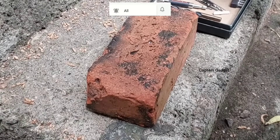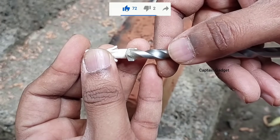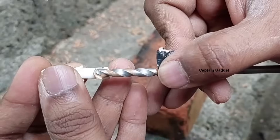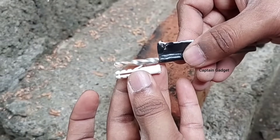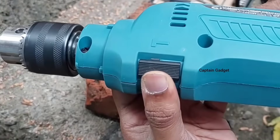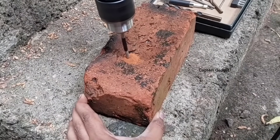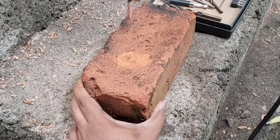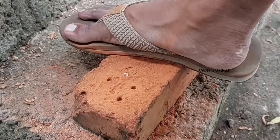For drilling brick, use a masonry bit. I am installing a wall plug — match the diameter of the plug with the tip of the bit. Mark the depth with tape and use hammer mode. The drill sound will be different because of the hammer mode. Insert the plug, then you can insert a screw. You can actually use drill mode too, because this brick is not that hard.